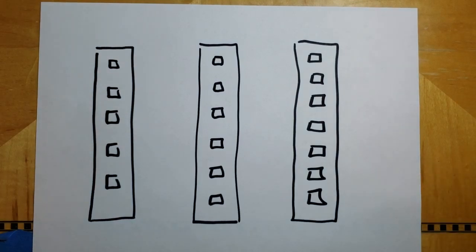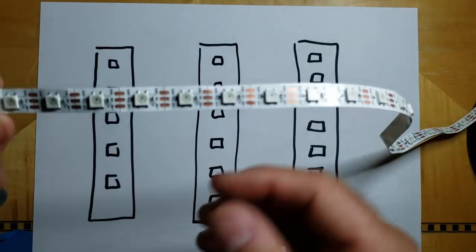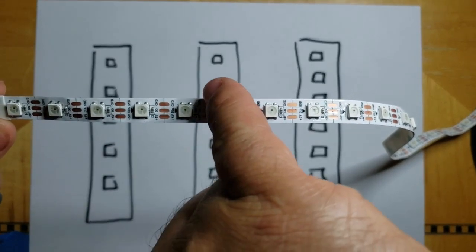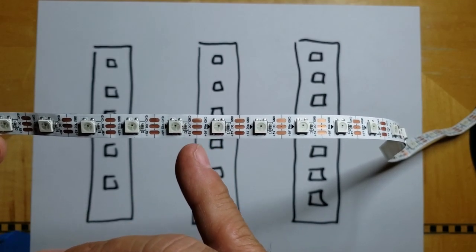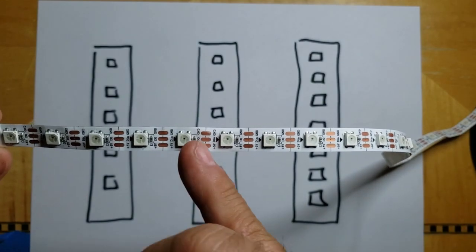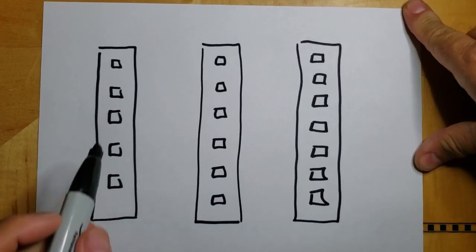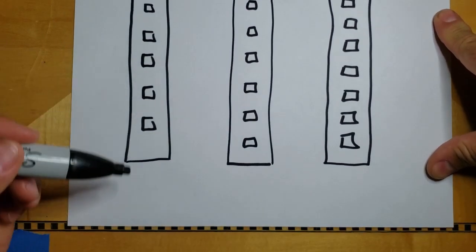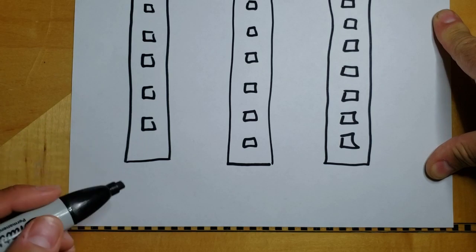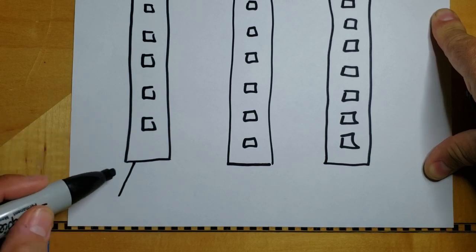Remember, I said these LEDs can be cut at any point where you see these little oval pads. So if you cut on that dotted line there, it gives you half of that pad that remains behind that you can solder to. You can solder little wires onto that. And basically this is 3 bands of many, but this is how it would start. So the first band, let's call it band 0, will receive the power, right? So this one will have 5 volts here.